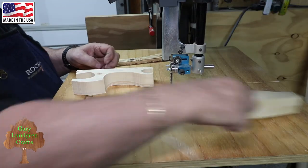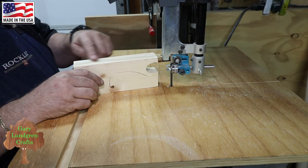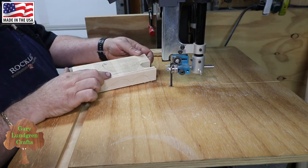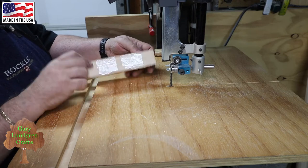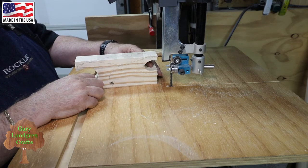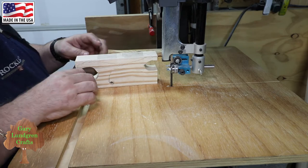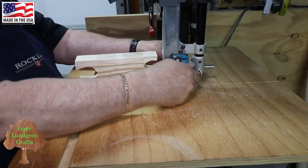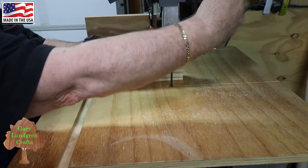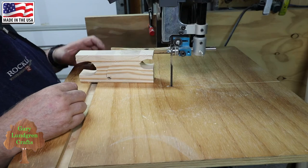Now I'll put these two pieces together that I cut out and wrap them with tape to hold it together so I can come back and cut the other pattern. I've got one here where I've done this already with tape wrapped around it. This time I'm using clear packing tape instead of masking tape so I can see through it and see my pattern and the lines to follow. Packing tape is quite a bit cheaper than blue masking tape and doesn't leave as much sticky residue either. So I'll adjust my bandsaw guides up, make sure I'm clear, then cut out this part and we'll have a finished reindeer.